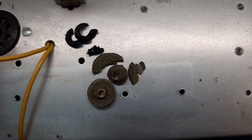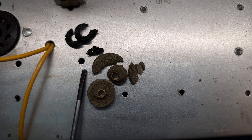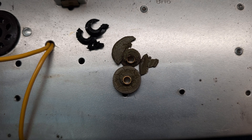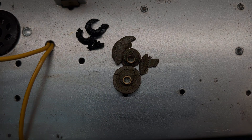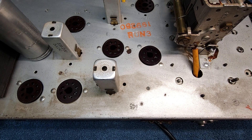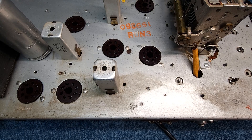These are the remnants of the bushings from the tuning cap. These gray ones — you can see they're all split and cracked and broken. This black one here was the back bushing; they've all been replaced. Looking at the back of the cap now, my screwdriver is pointing to where I put a new black bushing. It's a grommet that comes from a kit off of Amazon. It's been a wealth of goodness — it has all the right size grommets for doing the S38.